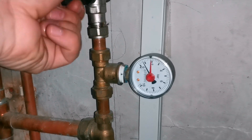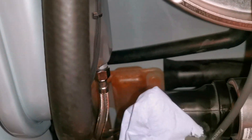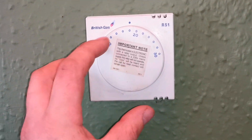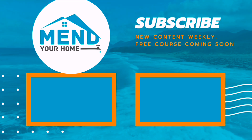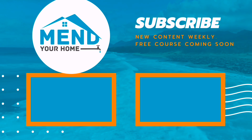Once we're getting into the pressure we want, go around and check again. I normally leave it for about five minutes and go around with a blue roll, wiping around all the joints I've disturbed. Blue roll is really good because it shows up any leaks clearly. Then switch on the boiler, get it running, and that's it — job done. If you like this video or want to know more about AAVs, there is a video — like, comment, and subscribe.